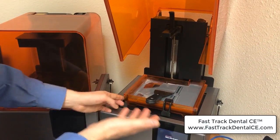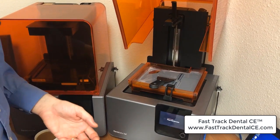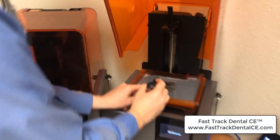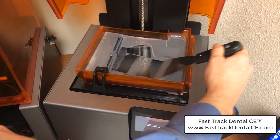A lot of people online get concerned about the Formlabs printer because they think if you get a little print failure, it's going to spill resin everywhere. If you're printing carefully, you won't have that problem. If you're pushing the envelope with a lot of supportless printing, then yes, you could potentially get an error. But using support modes for a tricky model means that if you do have a failure, all it does is leave a little cured resin at the bottom of the tank. You can feel the wiper bounce a little where the printing failure occurred.